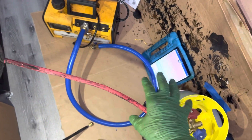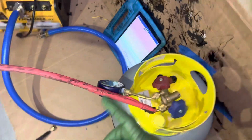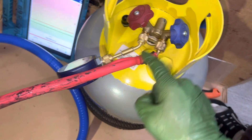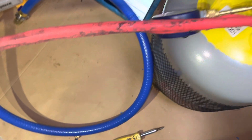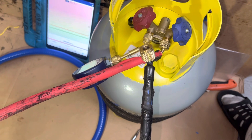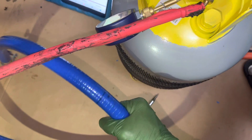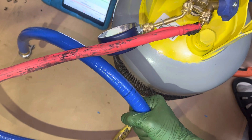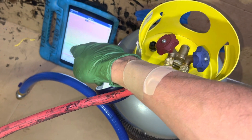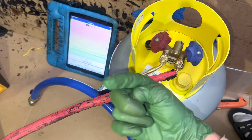This is going to be multiple videos — probably four, five, or six. I'm going to show you different methods of drawing vacuum. I'll show you one method using a single hose and show you the difference between drawing vacuum through refrigerant hoses that were never meant to draw a deep vacuum for a vacuum decay test, versus drawing vacuum through a dedicated vacuum hose that was meant for it. We'll data graph it and prove and show the difference between the two.